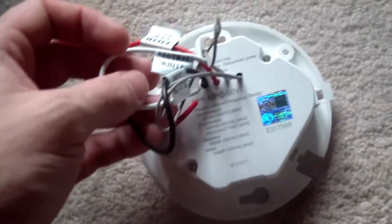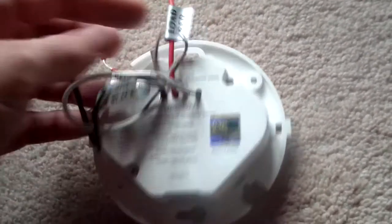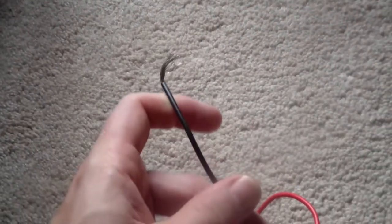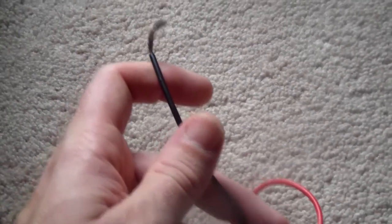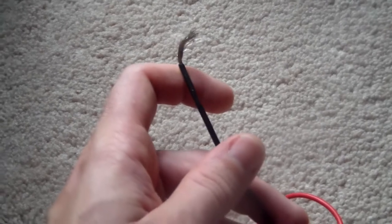I checked the wiring up top — we have a ground wire and one piece of Romex coming in with a black and a white. That is a neutral for the house and the switched hot leg from the switch. So you've got black hot, white neutral, and a red load wire. The black ties into the switch leg — pretend there's a switch on the other side breaking and making this contact — that's our wall switch, which can break or make the hot coming into this sensor.